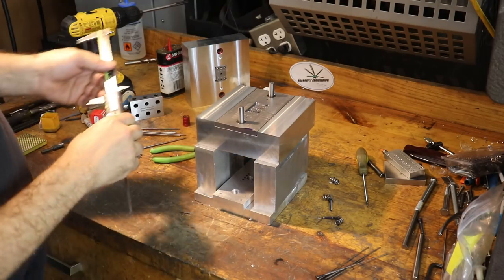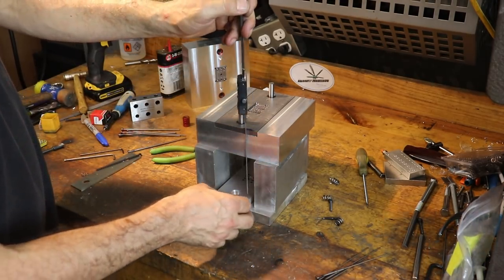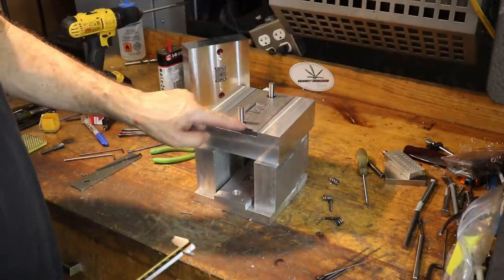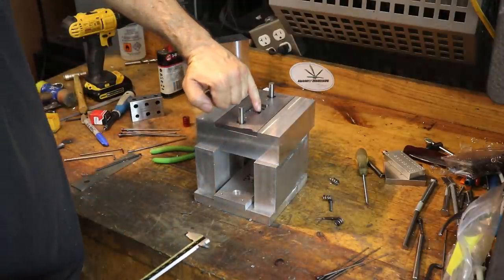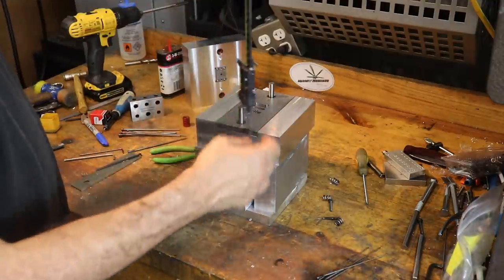Okay, I'm back. So I roughed out the ejector pins, and now we're gonna get a more precise dimension of the height of the ejector pins, because we need to essentially find this height where the blue marker is that I roughed out the pins, and then subtract the height of the pocket down to where the mold surface is. So it's gonna be this height minus that height.